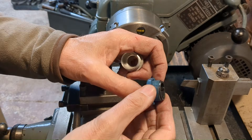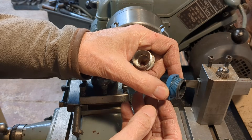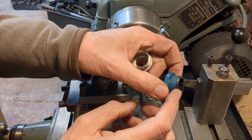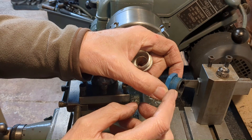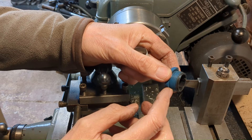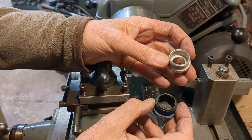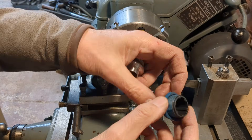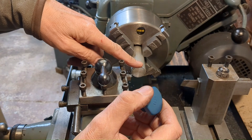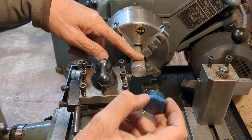Before cutting the thread and preparing this bush, I took another look at the blanking plug in the cover on the motor, and I think that's actually a metric size — seems to be 25mm with a 1.5mm pitch, which is quite close to 17 TPI at one inch. So we're going to cut that metric end to mount in the cover, and use the imperial thread for mounting with the conduit.